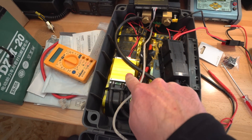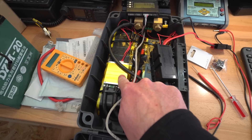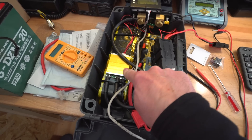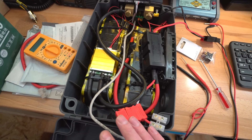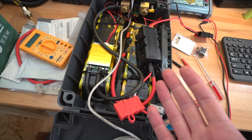This system only has four cells, so do we really need to complicate it that much? Current thought is I'm going to remove this BMS. I did a few tests and found it does actually cut off per cell at 3.75 volts — if one cell hits 3.75V it disconnects completely, so at least the documentation is right on that. The only thing is that's not enough — I'd really want to charge up to about 4 volts per cell, but finding a BMS off the shelf that does that, I haven't found one yet and I've scoured pretty hard.